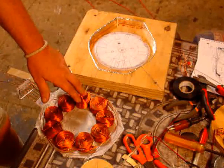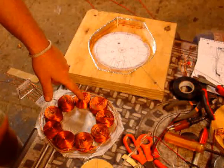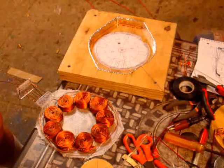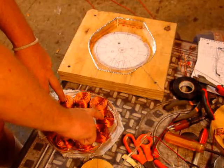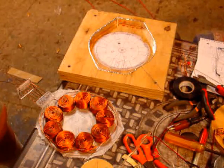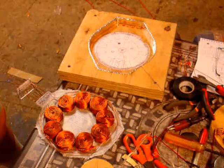I thought that being too small of a hole inside wouldn't really do too well, but talking to another expert, he says as long as the center of this is over the center of the magnet you're doing good. He said I'm cutting it close, but this will work and be alright. When I tried the test coil, it did great. I multiplied it by 1.42 to go from RMS to peak-to-peak, then multiplied by three for three coils, and then by two for the other phase, and it came up just above target voltage. I'm quite happy with that. I'm real glad it's an axial flux — it's going to spin free in the lower winds, and when it gets up to charging voltage it's already in cut-in. I'm kind of excited about it.